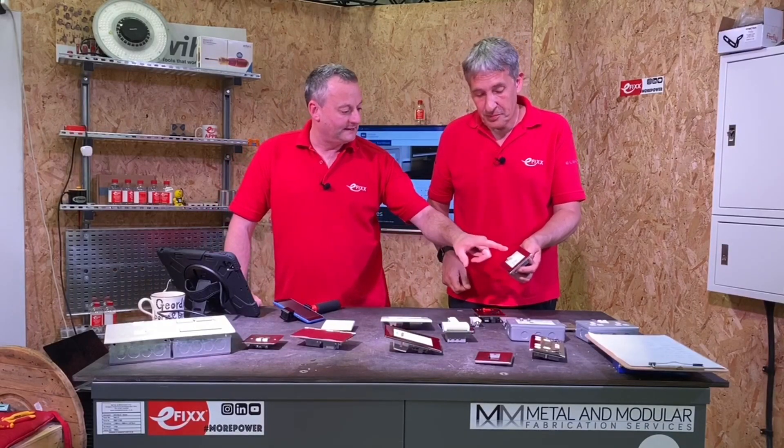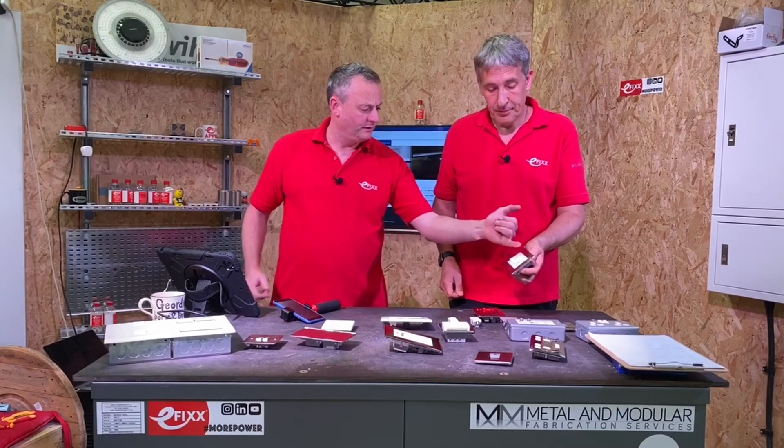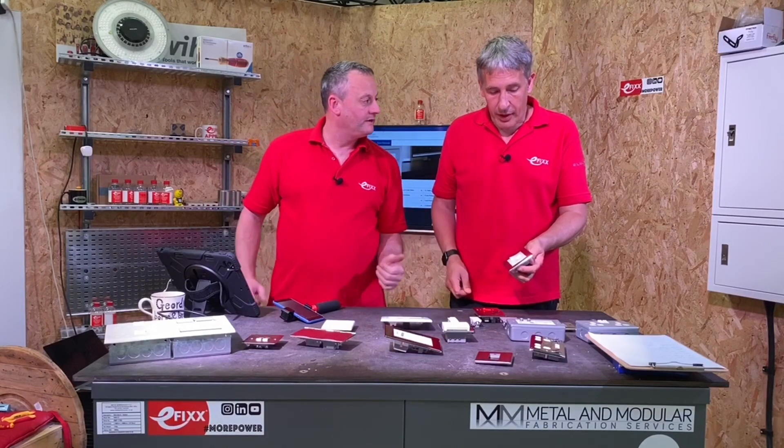And what's great is that if you wanted to upgrade to a different style of USB charging in the future, you just unclip the module and click in the replacement. You're not tied to replacing the whole face plate, which is one thing to love about Euro modules — it's that future upgradability, because who knows where technology is going.